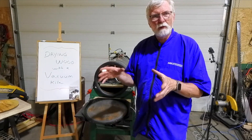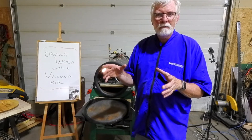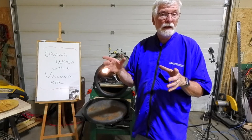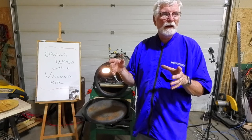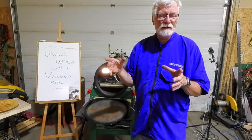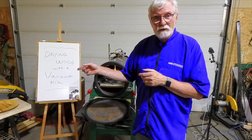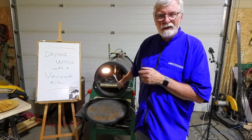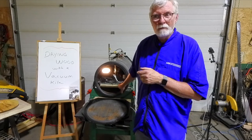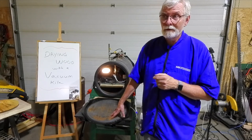So that's how it works: you put some wood in there, warm it up just a little, apply the vacuum, and make sure it stays for about three days. I automate it — I don't have the pump running continuously, just about 20 minutes every hour for losses. Out of those two pieces I showed you, I got three gallons — 12 liters — of water. They were more than 50% water. There's a lot of water.